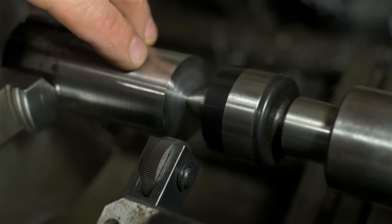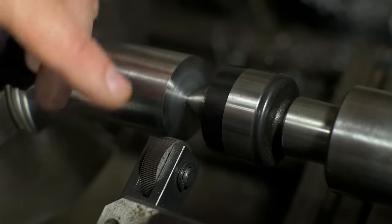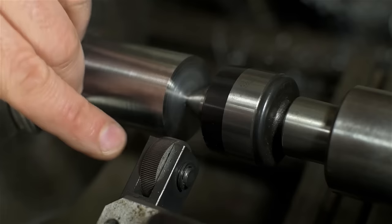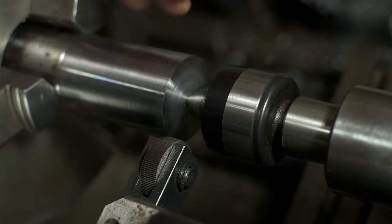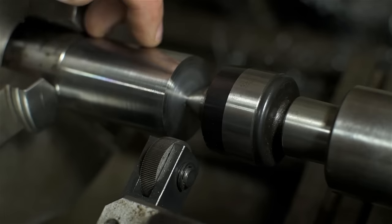Getting back to the case at hand, trying to put a knurl in chromoly, I've opted for a fine pitch tool. Probably not the best choice for what I'm trying to do. A little bit coarser may have been nice, but I think this gives me more of a fighting chance, since hopefully the forces involved are a little bit lower. And here, I've got a bit of a Pascal's wager going on. I have turned the diameter down. Let's give it a try.